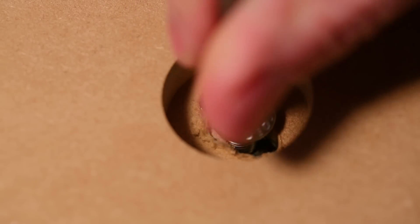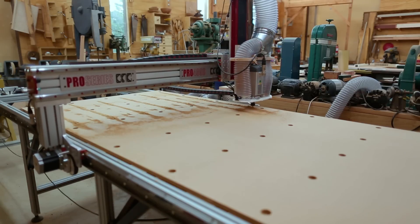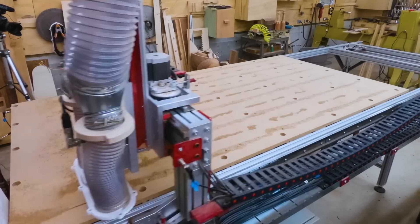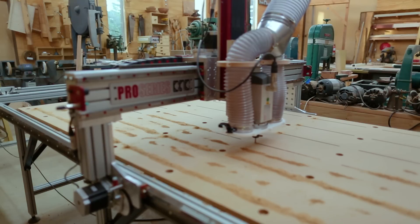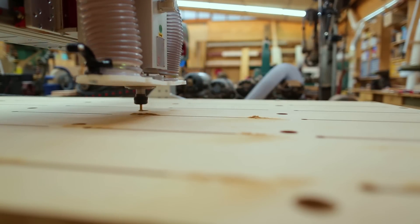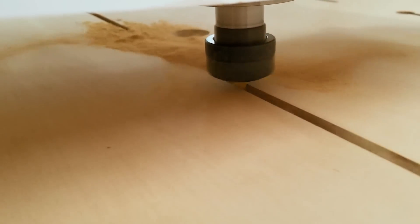I can put the bolts back in and my cross members were aligned much better this time. Now I wanted to cut T-slots into the table. On the last table I just cut the T-slots the full length with the T-slot cutting bit, but this time I decided to go a little deeper but make the slots only between the cross members. I started by clearing out most of the material with a quarter-inch bit, and once that slot was cut I could then cut just the T of the T-slot with the T-slot cutting bit — so the T-slot bit was only doing the last 10% or so of the cutting.